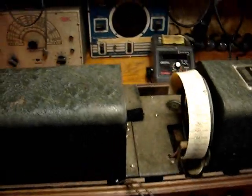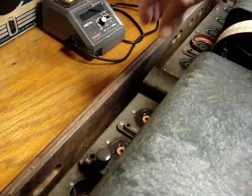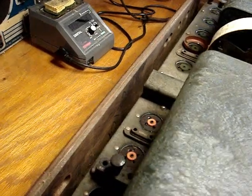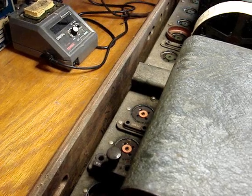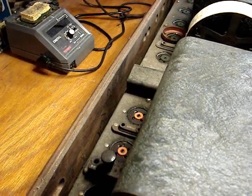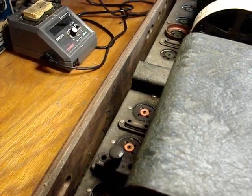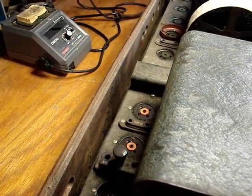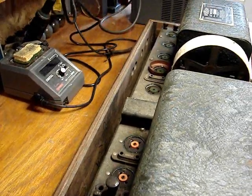A friend of mine said that when the radio heats up it may start cracking — I don't know, maybe it will, maybe it won't. That's something to watch out for. Also, these two tube sockets are clearly marked 171A, and that's what they are on the schematic. However, the tubes I pulled out are number 26 tubes. I don't know if number 26 tubes are appropriate replacements, so I may have to hunt around for a pair of 171A tubes, and from what I see on eBay, that's not cheap.